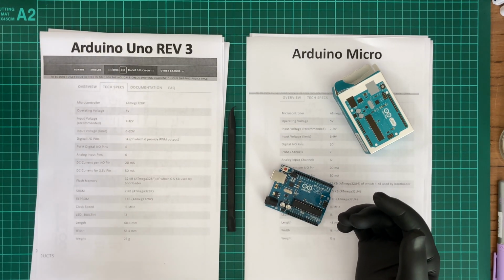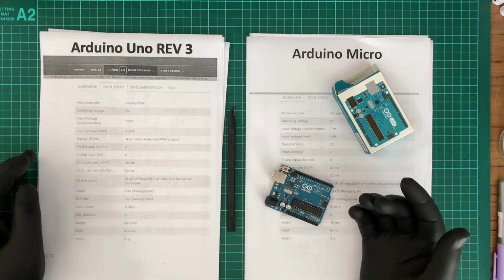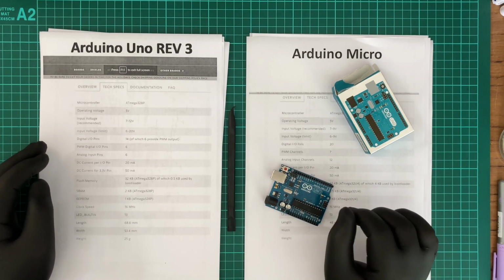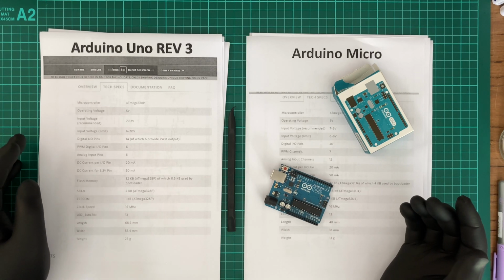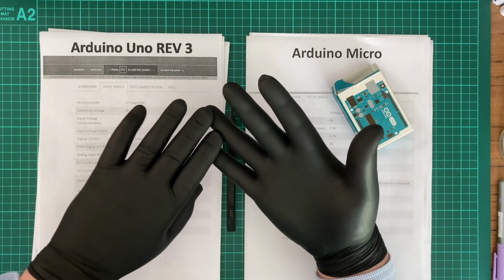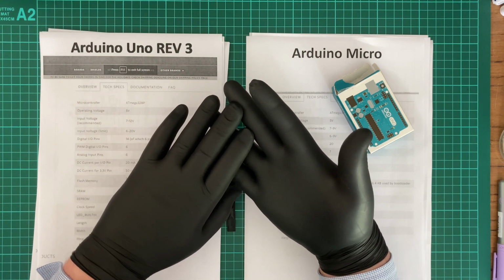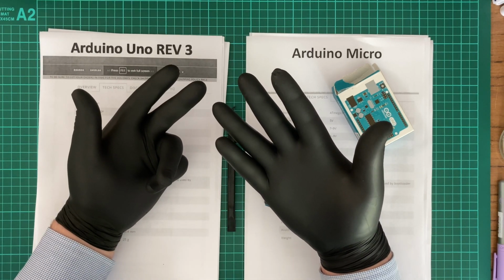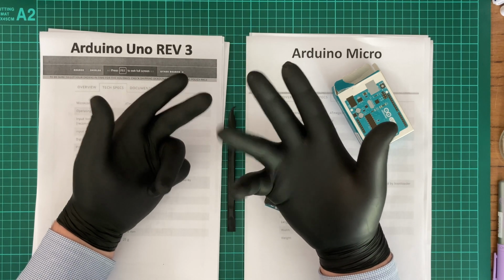Now, by all means, I could turn around and use a Raspberry Pi, but that's complete overkill. One of these is perfectly fine. I might even be able to get away with using an ATtiny with Arduino code on it. I shouldn't need all these pins. All I need is 2 buttons and a potentiometer, and that's it. No, sorry. Because it's RGB, I also need 3 digital outputs to control the RGB lights, 2 switches, and the pot.